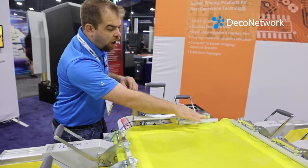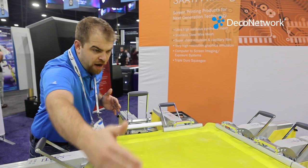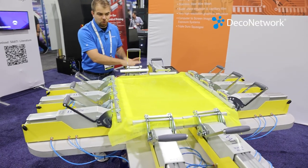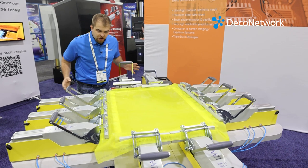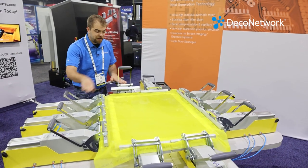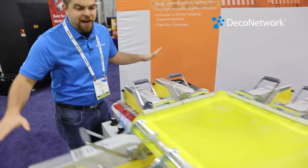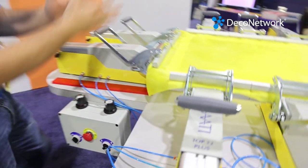This is your typical automatic press screen, 23 by 31 inches. And you can see all of the different stretching tools here. If you have a smaller screen, you just roll it off and you have fewer of them. If you want to use a bigger screen, you need more of these. So let's go ahead and stretch one. We'll bring down this clamp and it's all pneumatic, so it's all driven by air. You can see all of the airlines are being ran.